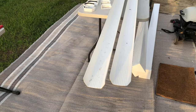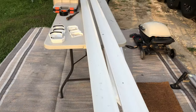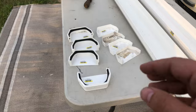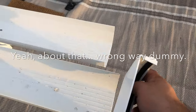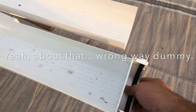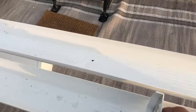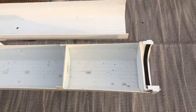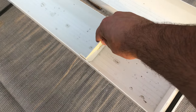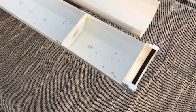With the tubes themselves assembled and the brackets made, I'm going to start on the drawers now. The drawers are just pieces of gutter — they are 10 feet long, which have to be cut down to something under 96 inches. I'll have an end cap on each one. It just slides right in. I will pop rivet it in for good measure because I love pop rivets. And so I can actually store my different pieces of elbow and whatnot, I'll be able to put in these little sliding insert caps wherever I want to, wherever the pieces are that I'm going to store. Pop rivet them in place as well. And that's about it.